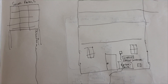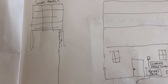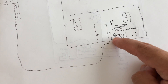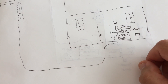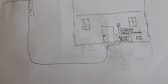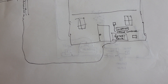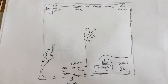Here's my crude drawing of the solar system and cabin wiring. You can see the solar panels running down in wire and conduit underground, up into the charge controller, then back down into the battery box, and then from the battery box to the inverter. That's how the power comes in and charges the battery bank. From the panels to the battery bank I'm using 8-gauge wire, and 2-AWG wire from the 12-volt battery bank to the 12-volt inverter.